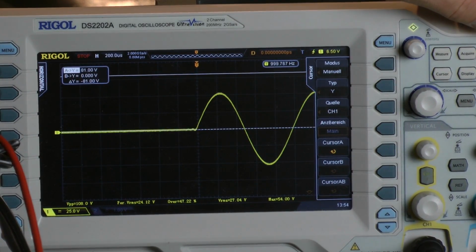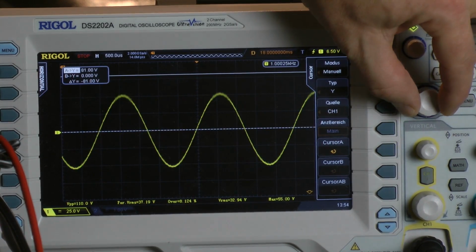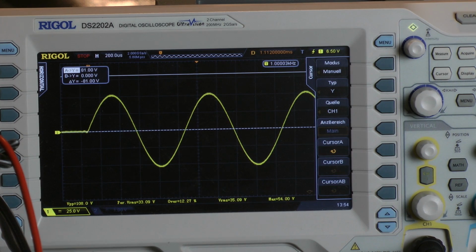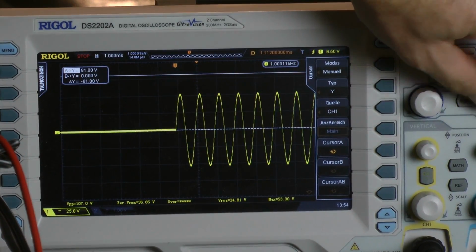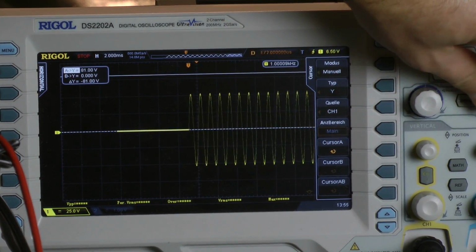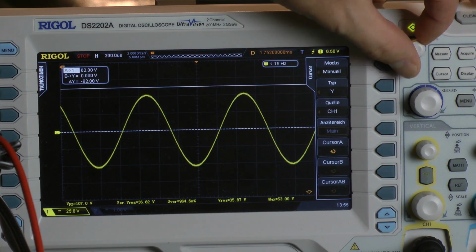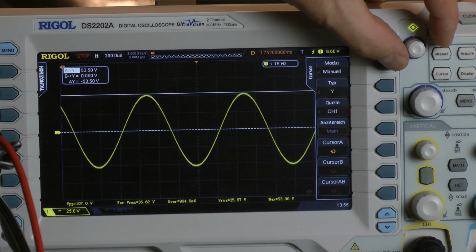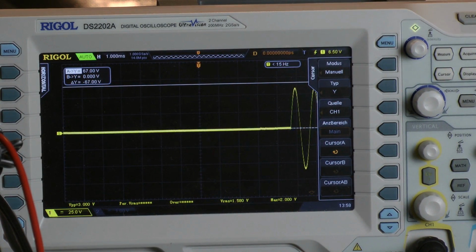I checked the first cycle, that's okay. I go to the last cycle. I can reduce my gain a little bit more. That looks much better. It says 53 volts. I have 53 volts. 2 ohms mono. The amplifier puts out 702 watts and 351 watts of dynamic power, 20 cycles, into a 1 ohm load per channel, both channels driven. 8 cycle dynamic power test.